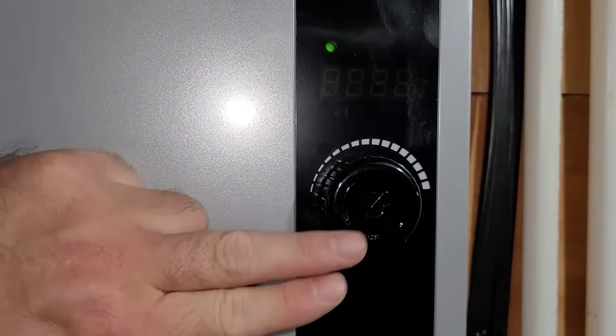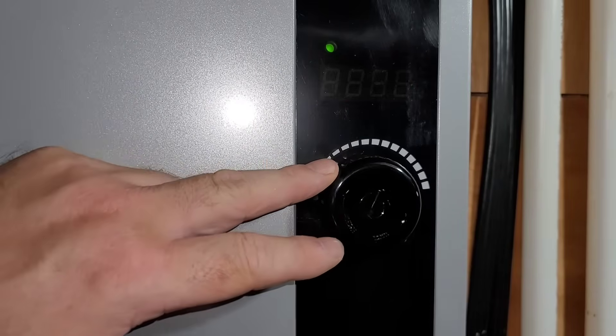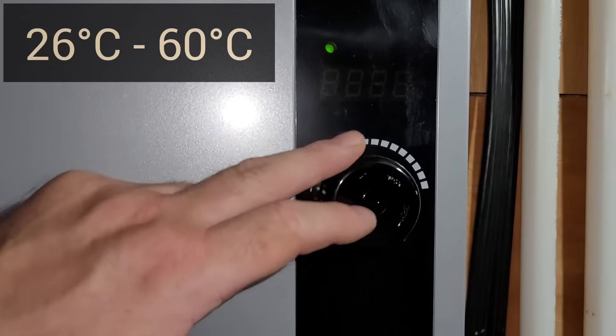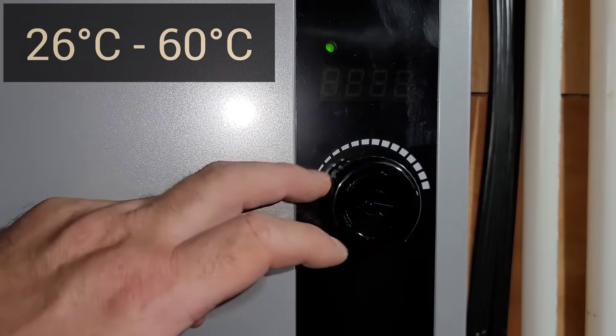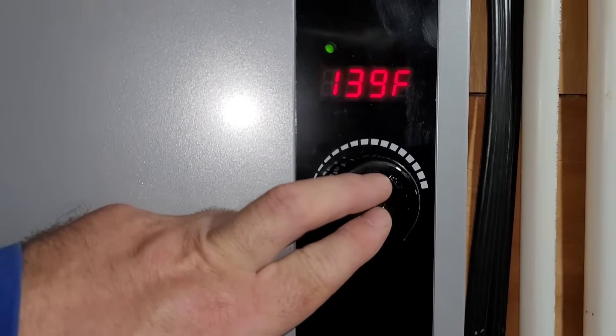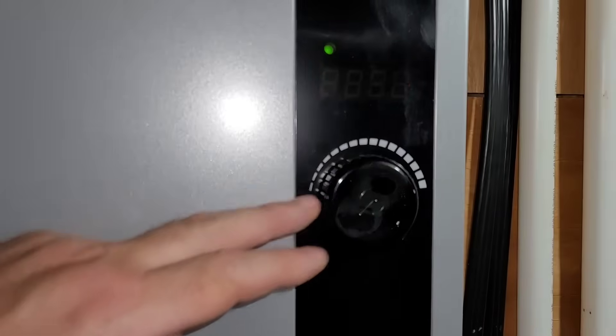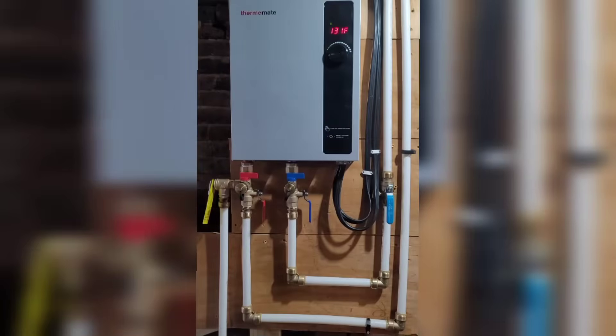Let's put the lid on. The green light tells us we are wired correctly. We can push this button to turn on the unit — the dial goes as low as 80 degrees Fahrenheit and as high as 140 degrees Fahrenheit. To switch to Celsius, push and hold for three seconds; to switch back, hold three seconds again. Here's our final install. I'll tighten up the wires a bit more for a cleaner look. You can see we have our isolating valves and a discharge pipe here so we're not blowing hot water in our face if we need to service it.